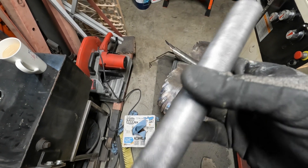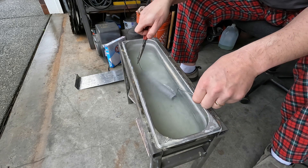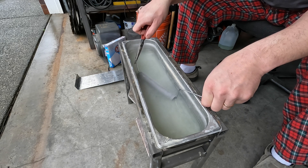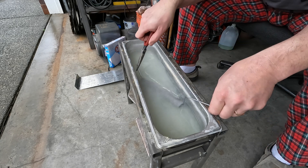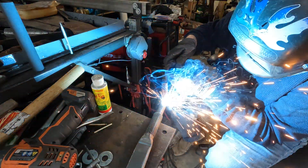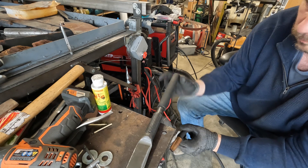This next segment I call 'parkerizing in your pajamas' - I highly recommend it. It's very relaxing: on a Sunday morning you heat up your parkerizing tank without bothering to change. I'm parkerizing this handle to produce a nice dark finish - it's more of a grayish but very dark - and that's going to slide over the round portion. Then I'm welding a piece of all-thread, half by 13 threads per inch, to the handle.